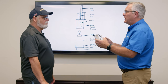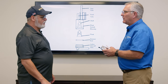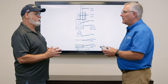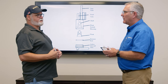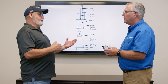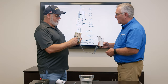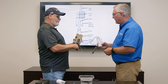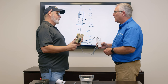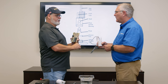What if my ice machine is acting up and I suspect the float switch but I don't have a voltmeter? You would follow the sequence of operation. If the compressor doesn't start and it just fills with water constantly, that's a good indication your float switch is an issue. You can unplug the K5 connector from the board. After one minute, the board is looking for the K5 connector to show a closed circuit. If it's just filling with water, wait one minute and jump the top two pins on the K5 connector — if the board cycles, you know the float switch is the problem.